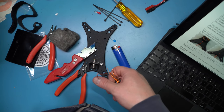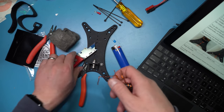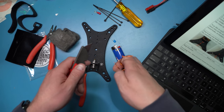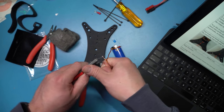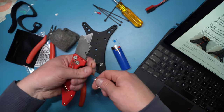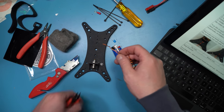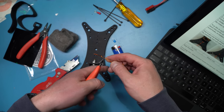If this was some fine magnet wire, I definitely would not recommend the scraping method. I would be very careful because I have actually just ripped a piece of wire right in half on the thin stuff — enameled wire can be pretty flimsy. This is not that case. So just keep that in mind: if you're building the Coffee and Ham radio antenna, you can largely just use a utility knife if you want to.